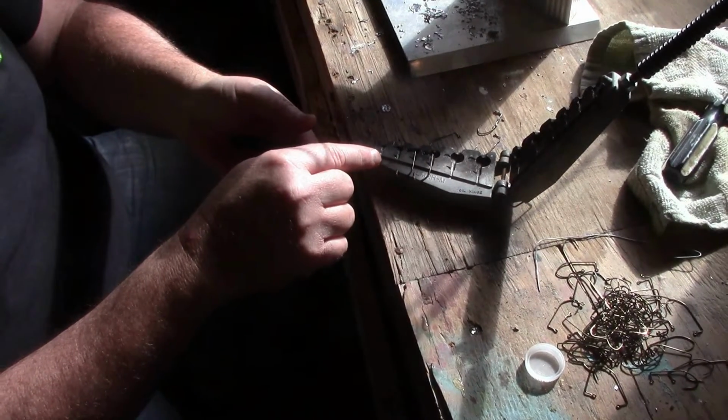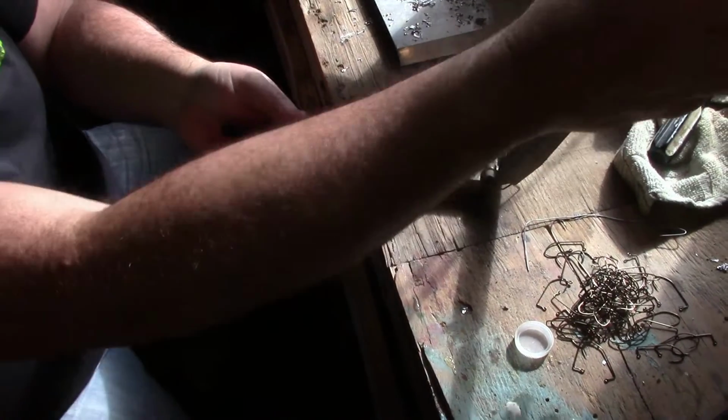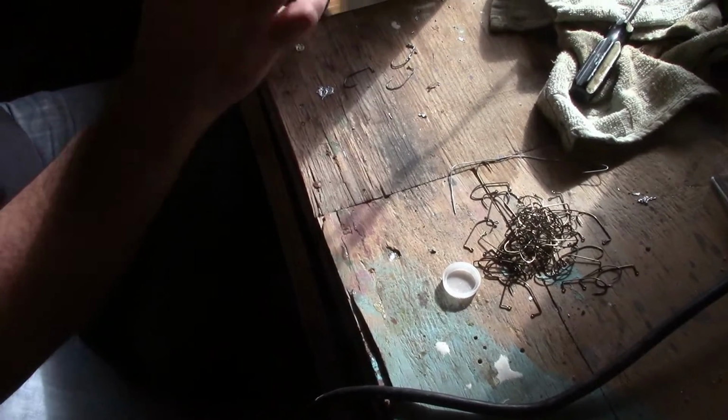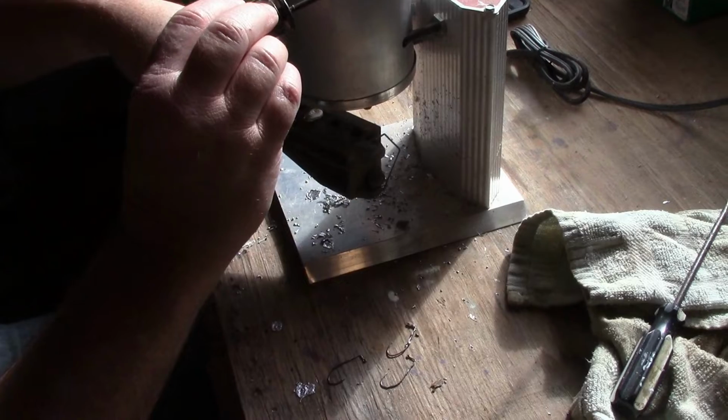And right there's how you do it. You just got your 1/8 ounce and your 1/4 ounce. You just lay your jig hook in like that. Then you just bring it down, shut it up, squeeze it really tight where the seal and hold the lead. And then we'll just pour us a couple like this right here.